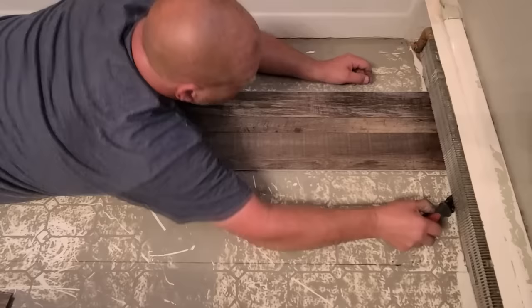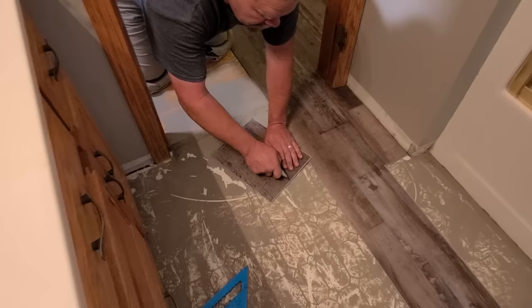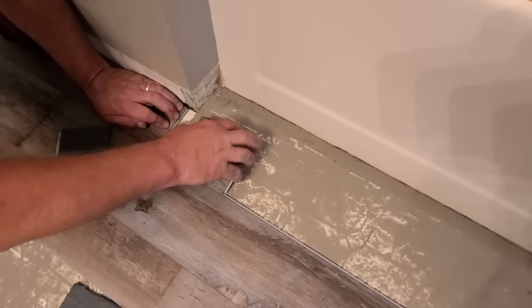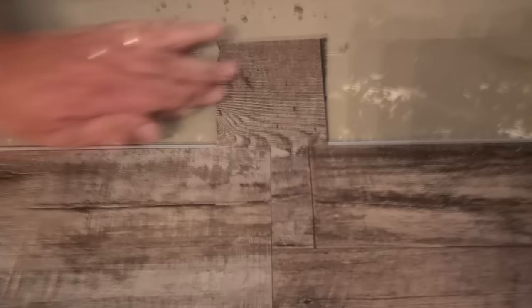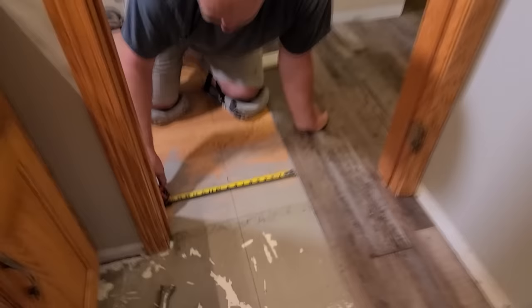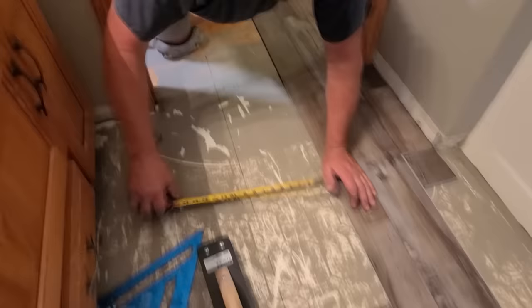This is a little more difficult because I have a radiator here. I'm going to cut a strap and do a few different pieces. I'm going to come right here, hook on right here where this comes together, put one on the seam, and then another one down here on the end. Now before I screw this down, I'm going to get it all straight with this line. I'm coming up here now where it's attached to all the floor and I'm going to measure to see — we're at nine inches — and I'm just going to make sure all this floor is at nine inches now.